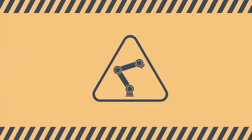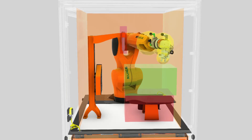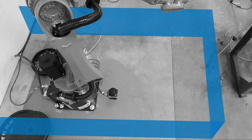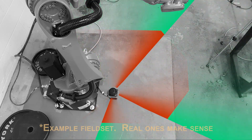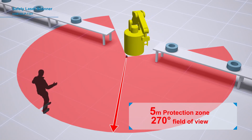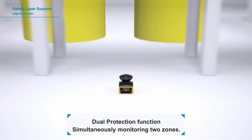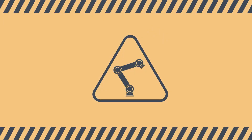I'm using two different systems to make sure Susan's safe. The first is called Safe Operation from KUKA — it lets you set up workspaces the robot is allowed to work in, like invisible fences the robot cannot escape from. The second is a safety lidar from Hokuyo. I have it scanning all around the robot, and you can set up specific areas that nothing can enter. If anything enters those protected areas the robot will either pause or completely slam on the brakes. These fields are completely configurable, so as applications change I can adjust them to line up with whatever working area the robot needs.